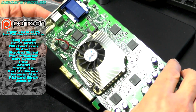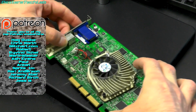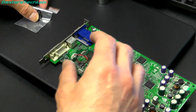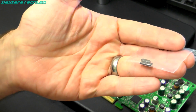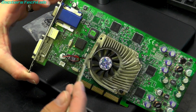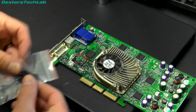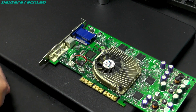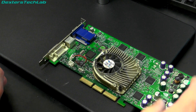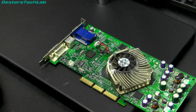So we've got 128 mega DDR RAM on here. I think what has actually happened is the heat sink and fan has become dislodged and what it's done is it's actually knocked off one of the crystal oscillators which would sit just in there. So it looks like that is all that's wrong. Now what I'm going to do is get this under the video microscope so I can actually see all the components around there a little bit better, because they're all pretty small and it's hard to see otherwise.